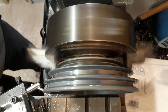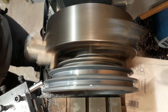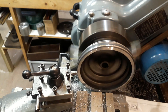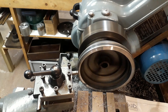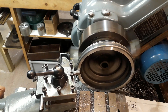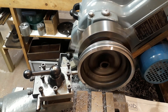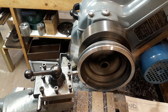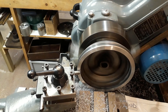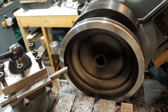I've set the pulley up in the four-jaw chuck again just to dress up a couple of the grooves, setting it over to the correct angle for the V-belt. I'm also going to tidy up the lower face of the pulley — that's probably cosmetic, but the grooves have been damaged; somebody's hit them with a hammer so I'm just tidying those up. The other advantage of facing up the lower side of the pulley is it gives you a datum face for setting up again should I need to remove the pulley and reinstall it. And in fact I did need to do that, so it was helpful to have a nice face to put the clock on. We add a couple of chamfers — an external chamfer and then finally an internal one — just to finish the job off nicely.